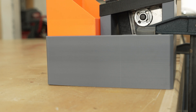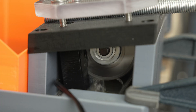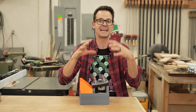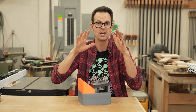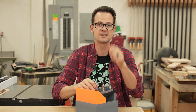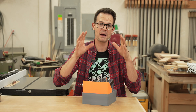That coolant block I have down in here for feeding with the little pump worked fantastic — actually a lot better than I was expecting. I turned the pump up just a little bit and it got cutting fluid all the way around the blade. I could tweak that so it wouldn't splash everywhere but would be fully over the blade, and it kept it nice and cool. I could cut a couple of full coils of rings and then touch it with my finger and it was perfectly cool every time. Coolant is definitely awesome — I would actually say you should use a coolant. Whether cutting steel, copper, or aluminum, all the cuts came out better when using the cutting fluid.